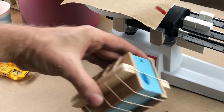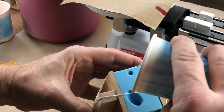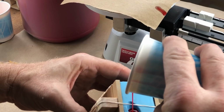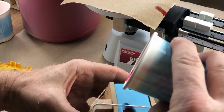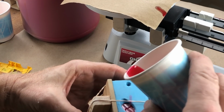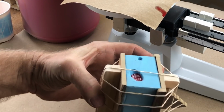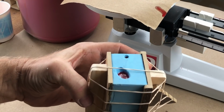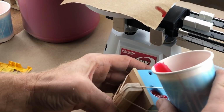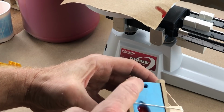This is how we're going to want that mold to sit in orientation in space, but I don't have to pour it in that orientation. I'm going to pour it like this. Well, that little sprue is letting it fill slow. It's got a very thin sprue. Okay. Oh, there it is. It's already up on the other side. I don't know if you can see it. I have to be careful not to overpour it, but you can see the material has risen up.